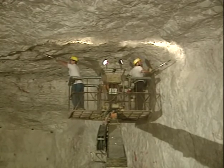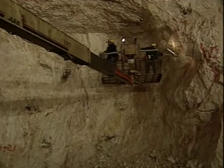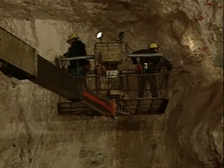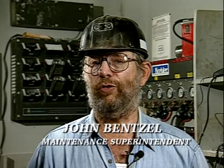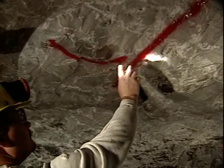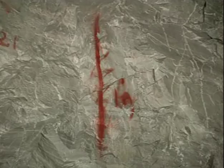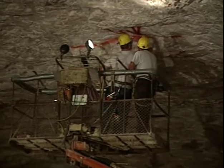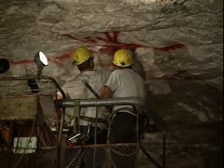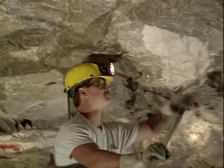As you work, always scale the roof, then the ribs, and then the face. This is the safest way to scale an area. The paint marks identify how far the roof has actually been scaled — whether mechanically or by hand scaling. It's a line drawn onto the roof and ribs, and it's dated. When we load out from the face, the loader goes no further than the line that's painted on the ceiling or the rib. Miners with any questions regarding roof control or scaling should immediately call their supervisor. If it's a questionable stone, our experienced supervisors will personally get in the basket and investigate it.